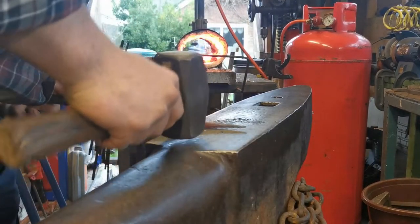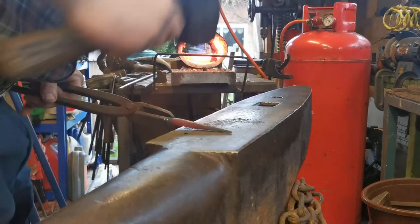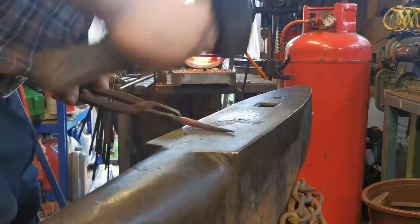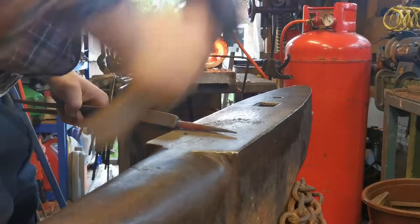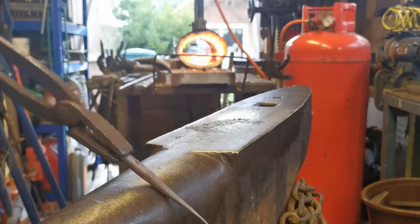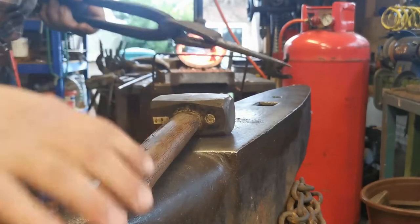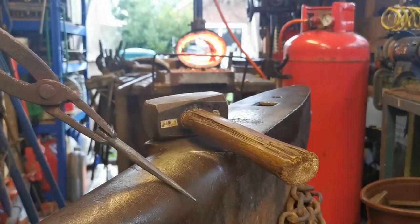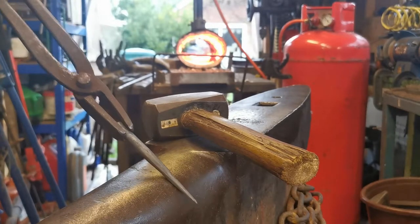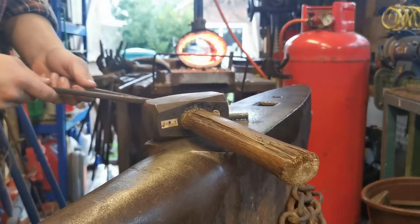Because it's an icicle, what we're going to do is go back down it with faster turns and a couple of harder blows, and that will just rough it up a little bit. So you haven't got any particular sides to it - it's just a little bit rough and tumble, not quite so clean. It's a bit more bumpy, like an icicle. So now we're going to flip it over and stick this end in the forge.